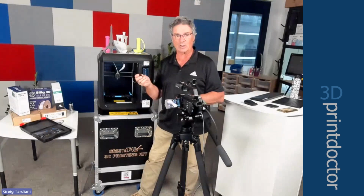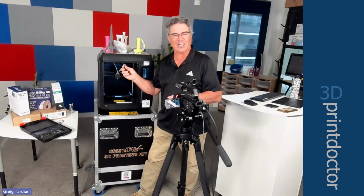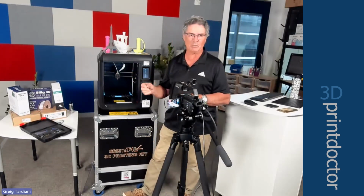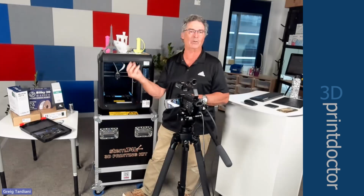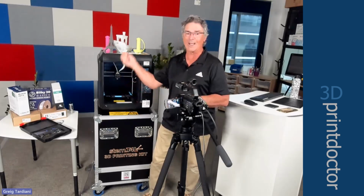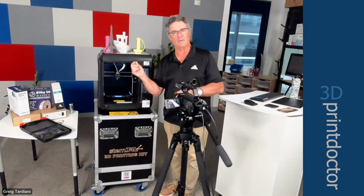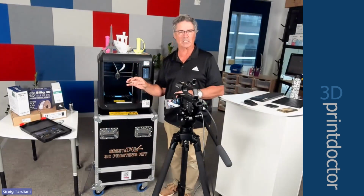But you do need to make sure that you've got everything working with you, and filament is what I'm trying to get to here. Unload your filament over the holidays. Don't leave it in the printer. It will probably not cause you any problems with these new printers, but it can sit in there and give you trouble the next time you start if you get yourself out of sequence. So a little rule of thumb that I like to use is if I'm not using my printer for any length of time, I will unload the filament so that the nozzle doesn't clog up or cause any problem. The filament can get brittle. Now, here's the weird thing, and I think I said this in one of the episodes prior.